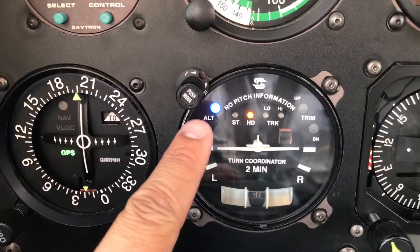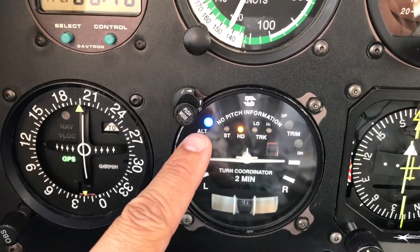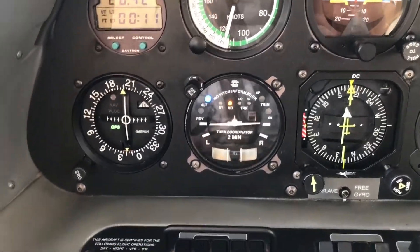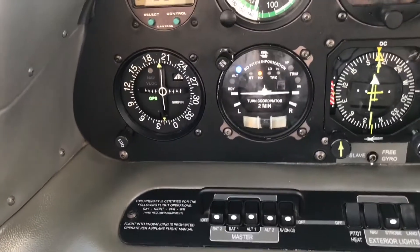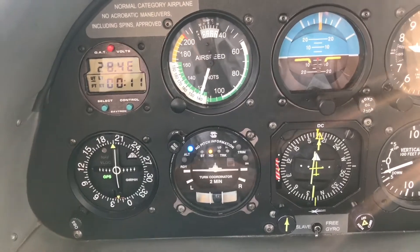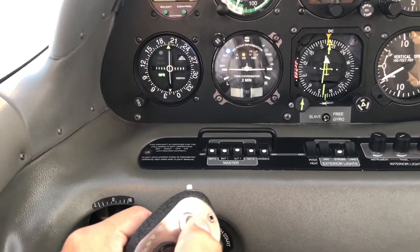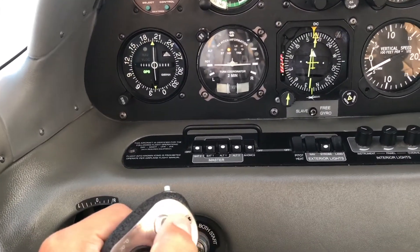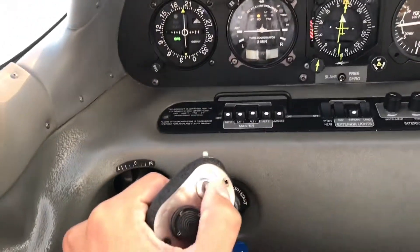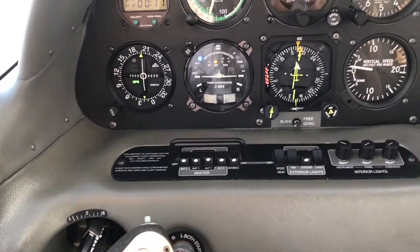See what appeared here on the autopilot annunciator — the altitude mode is selected, and by that blue light I know that the altitude hold mode is engaged. If I'm given an instruction by ATC to climb or descend, I'm gonna disengage the autopilot altitude hold with a click — see that light go off. I'm gonna climb, and when I reach the required or requested altitude, I'm gonna select the altitude hold mode again. That's it — it's pretty simple to use. I cannot climb or descend using vertical speed; I will need to do that manually and just hold altitude with the autopilot altitude mode.